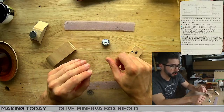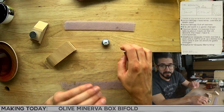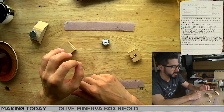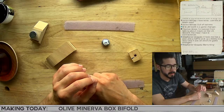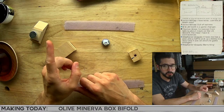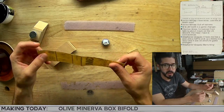The key thing to note is that if you're using a high-grit sandpaper, it immediately nullifies the effectiveness of it. These are not for use with high grit, so don't use it with anything higher than 400. And I think 400 even is a little high. I know Tang goes down to 220 grit. I find that 320 is the best one for cutting edges down.